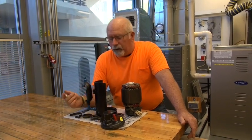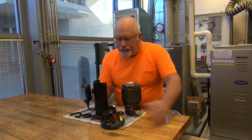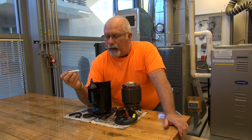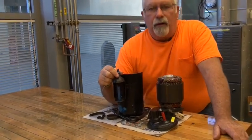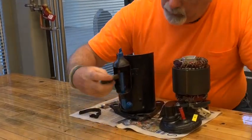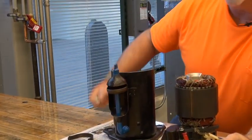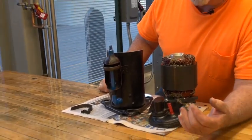Read it because you're going to explain it to the faculty. Now let's discuss the low-pressure side. It's coming in and you might wonder what this is. Well, what it is is a filter mechanism. You've heard the term slugging, where liquid refrigerant will come back into a compressor.